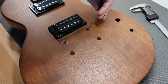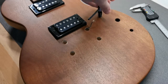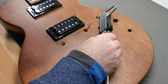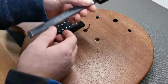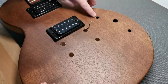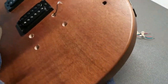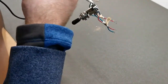Once I've loosened up some of the initial wood material, that's when I've inserted the small pry bar there, and you just want to go slow and check your measurements — it does not take much. Depending on the quality of the hole reamer it may cut quite quickly, or if it's a cheaper, more dull version it's still going to work, you just need a few more turns. Then of course just make sure everything fits.